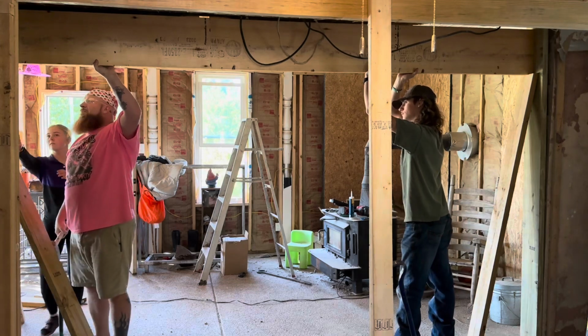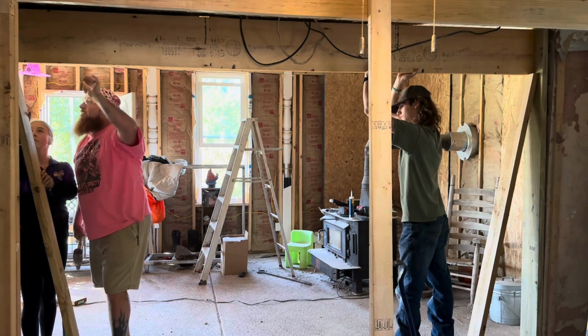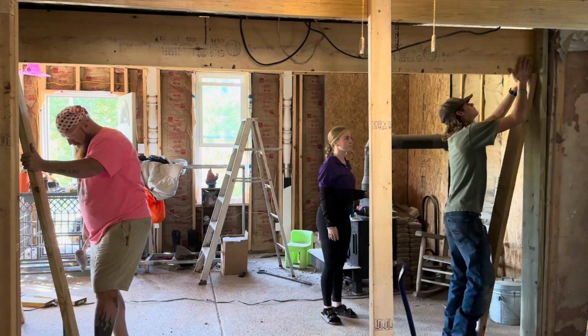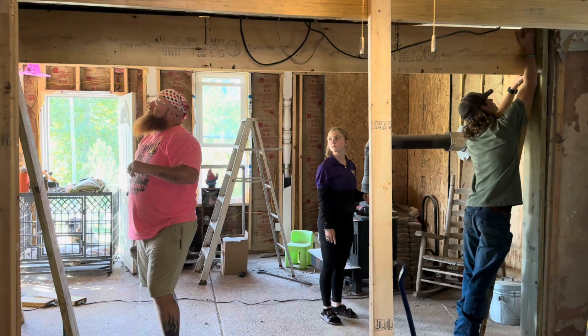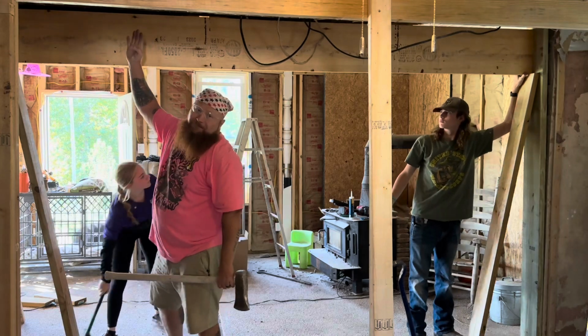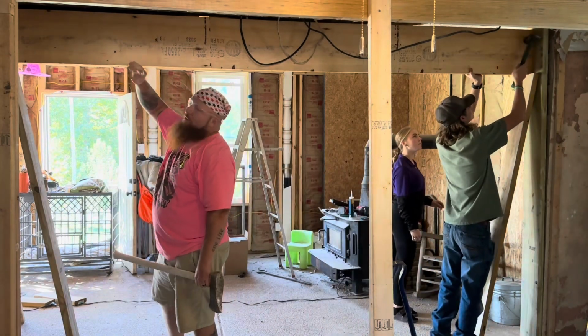That upright in here, G. Okay. There you go. These uprights, y'all, are intentionally just a little over a quarter of an inch too long. And that's so that when we drive this in and it presses that up, it's going to be very firmly against that old rafter that's supporting all those joists.